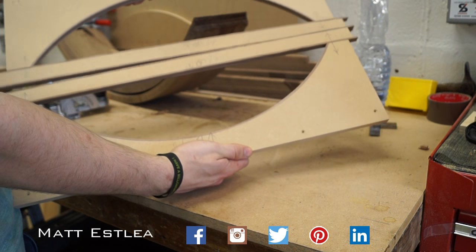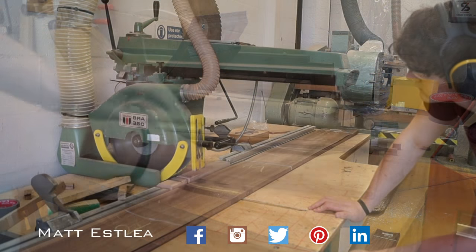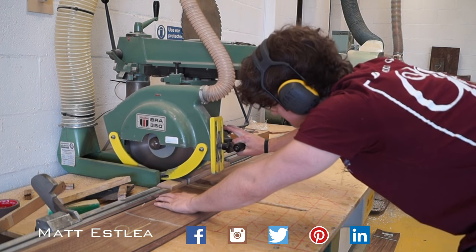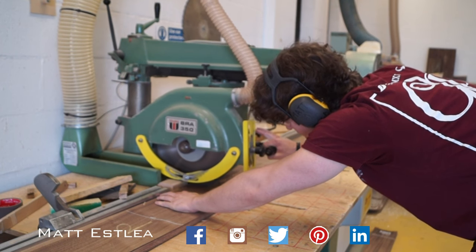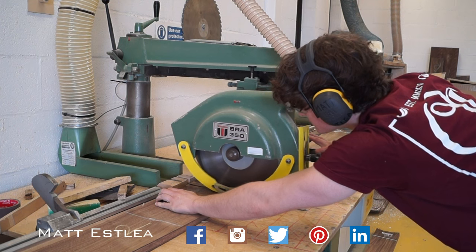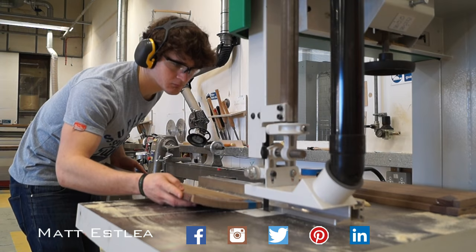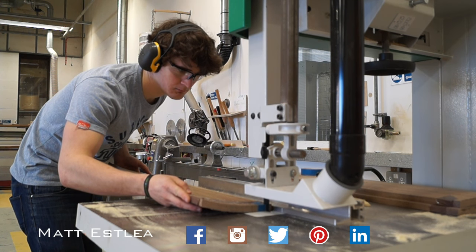There is the result — a small 4mm slot that I can insert a domino into and easily assemble the frame together, or two frames for that matter. I also got my constructional veneer this week, which was from Mundy Veneers. Bit of a hit on the wallet at £270, but it is very good quality — really nice and consistent so you can't really complain. I'm just cross cutting it all to rough lengths before laminating, and then cutting it down to rough width so it will actually fit on my laminate formers.